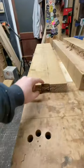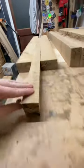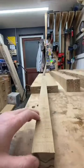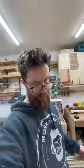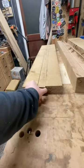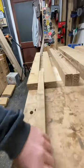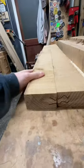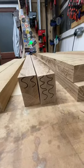This one I haven't paired up because of the pith — you can see it's really close to the centre of the tree, which is a little too close for my liking. So I've taken this one out and it'll be one of the back legs — specifically the back left leg. You'll never notice. That's what we've done today. I said I wasn't going to be working much this week, so I'll see you tomorrow. I'm in here tomorrow because Katie and baby Riley are out. Bye.